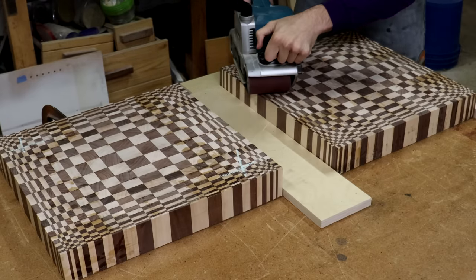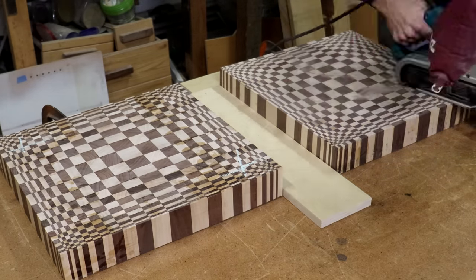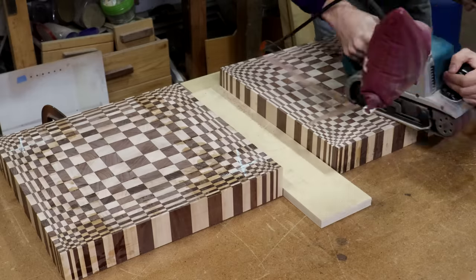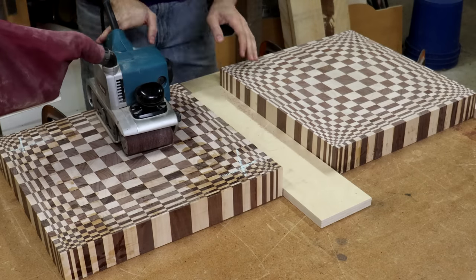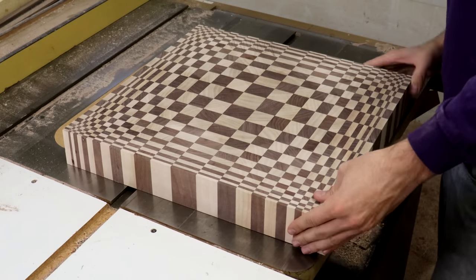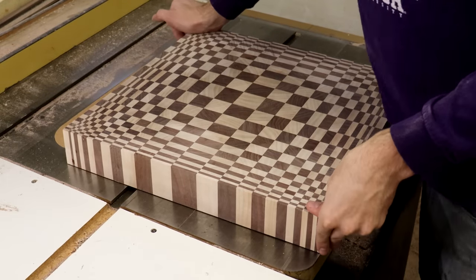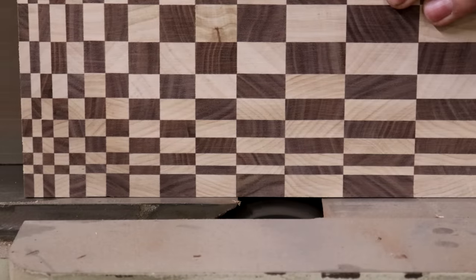Now here you can see both boards all glued up on the table, and the next step is to sand these flat. I'm using a handheld belt sander going over the faces to sand down all the glue marks and get rid of any low spots between the strips. They're not going to be perfectly flat doing this method, so I periodically went back and forth to the surface of the table saw to check for flatness, marked any high points, then took it back to the belt sander until I was happy with it. Once I was happy with that, I took it over to the jointer to trim up the edges. When making these glue ups, the thinnest strip is on the edge but we made sure to leave the edge strips thicker to give extra room for trimming at the end.